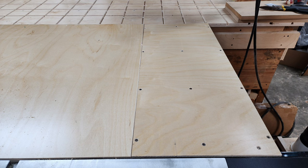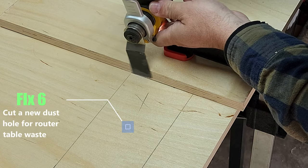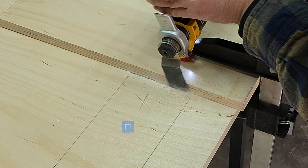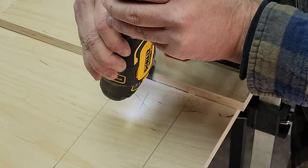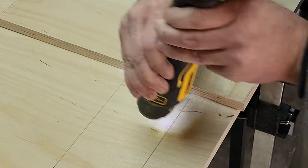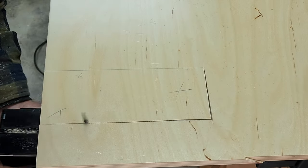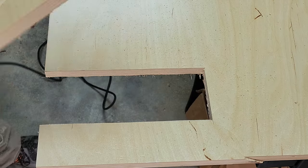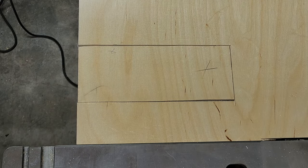As you can see, that looks pretty good right up next to the old outfeed table, and I can easily slide that over if I need support on thinner stock. Here I'm just taking an oscillating tool and trying to cut a thin line to get a clean cut on this piece. This is going to be the cap for the dust collection chute, and I'm going to reuse this piece - that's the reason I wanted a thin line. A couple straight cuts with the jigsaw take care of the rest. And there it is. Not pretty, but it gets the job done.